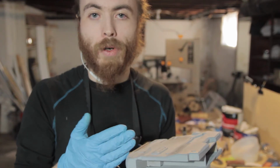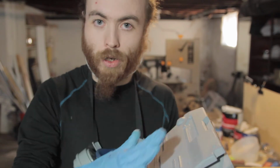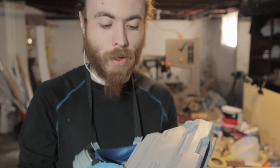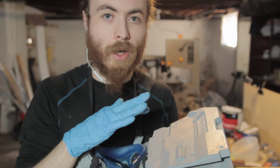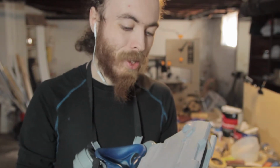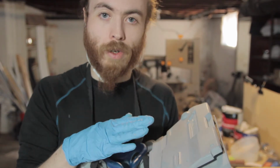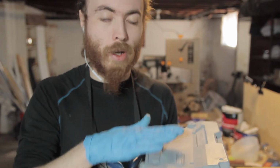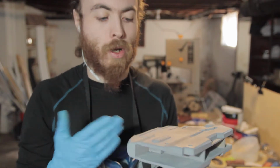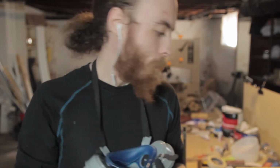So as part of the casting process, as it comes out of the mold and it gets ground down, machined into its final flat planes, there would be natural little voids here and there in the surface. And also, practically, the 2 coats of dark primer and the 2 coats of self-leveling clearcoat will probably take care of much of the rest of that filling in process. So, yeah, let's get on with that.